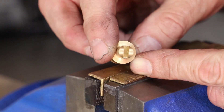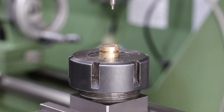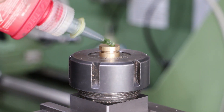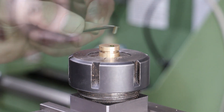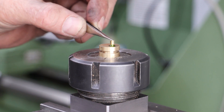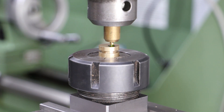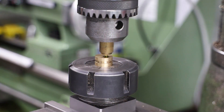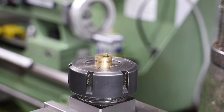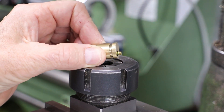The final feature for the piston is a small pin to be inserted on the steam face. I assume this is to prevent the piston retracting right back to the cover and giving no room for the steam to act, as well as to prevent it from blocking the hole through to the drain valve. Don specifies that this should be 1.6mm diameter but the smallest I have is 3.2mm, which is what I use. With the hole drilled, I secure a small piece of the bar with some Loctite 648 before turning it to length.